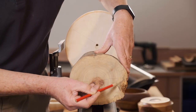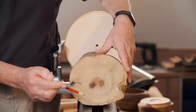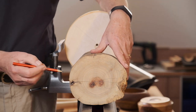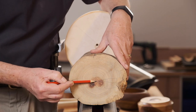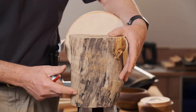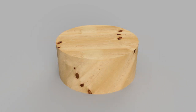The simplest way to approach bowl turning grain orientation is to take a medium round log and split it halfway down the length of the pith. After the log is split, there are two half circles that you can use to make two bowls. The flat side of the split log then becomes the top of the rim of the bowl. It's best to start truing up the blank by removing the excess corners and rounding the bowl blank on a bandsaw.